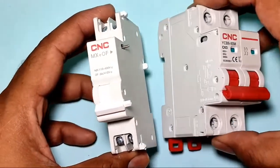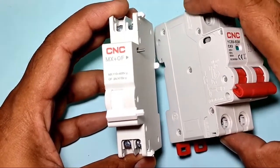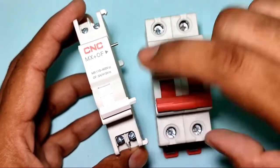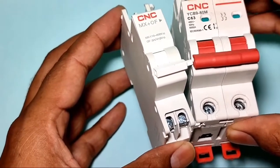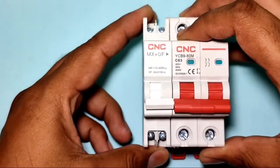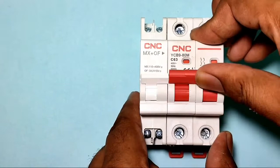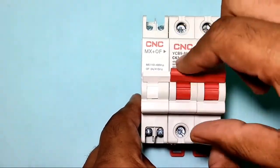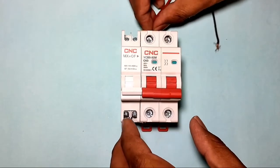The mechanism for connecting the shunt release coil with the MCB is very simple. This point connects here and we have two locks, so you can connect this shunt release coil very easily. The plunger first connects to the start/stop button. Once the shunt release coil is connected with the MCB, when you start the MCB, the shunt release coil also starts, and when you stop the MCB, the shunt release coil stops it.